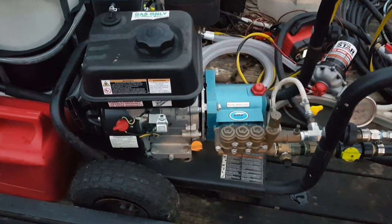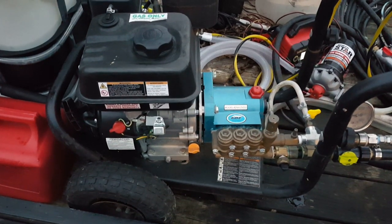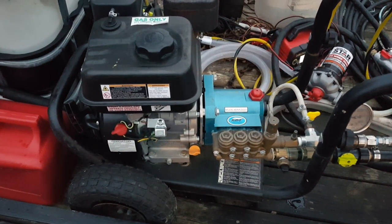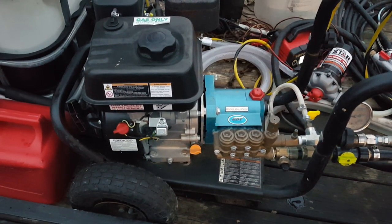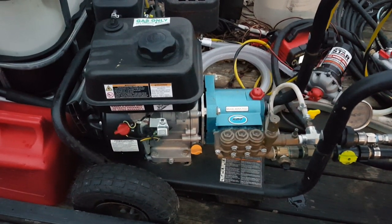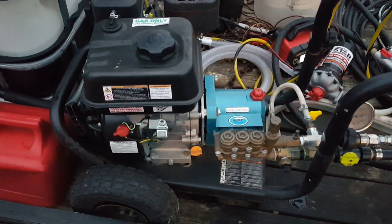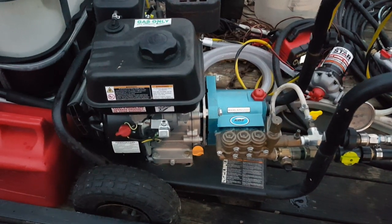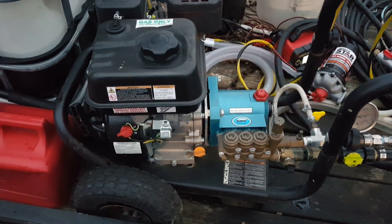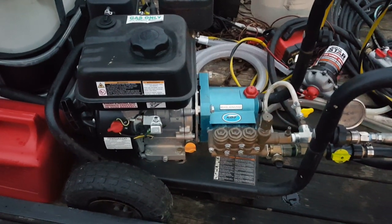Now, let me say, if you have a 2-story house with really high peaks, they have what's called a 2nd-story nozzle that'll shoot your water up. It's considered low pressure, and it allows it to draw soap at the same time. That's how I do it. I have my chemical and soap mixed up, and that's how I wash houses. I don't use high pressure to wash houses. Doing it the low pressure way with chemical is a much better way. And if you don't know what I'm talking about, you can leave a comment down below and I'll answer it.